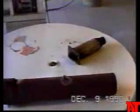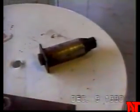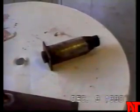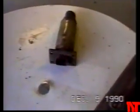And this is the first combustor off the first turbojet I ever made. It was using a Buick turbocharger. And basically it's just the same as our existing combustor, it's just muffler pipe. That end bolted up to the inlet side of the turbine housing. The other end came from the compressor. The small line is the fuel line, and the spark plug was also down inside there.